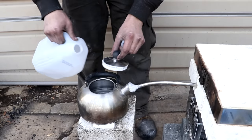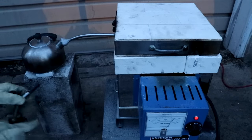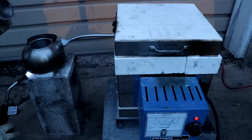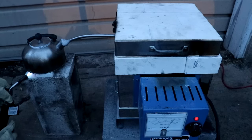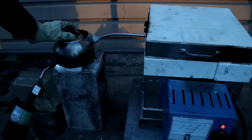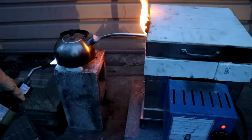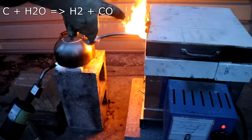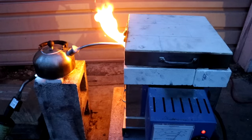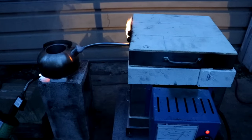There's the water. It's gotten a bit dark, but we're finally up to temperature. So I'm going to heat the kettle just with a blow torch here. And once it's boiling, close the lid and send some steam into the chamber. The kettle's boiling — I'm going to put in the steam. Look at that! That's carbon monoxide and hydrogen burning from the steam reacting with the charcoal and producing water gas. That means it's working. If I remove the steam source, it stops immediately.